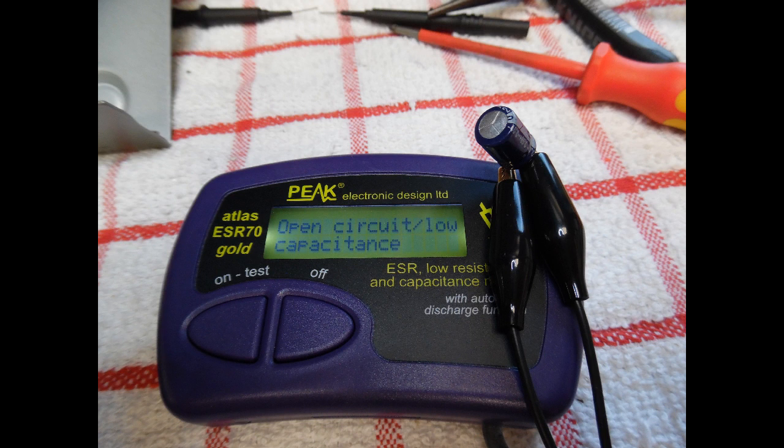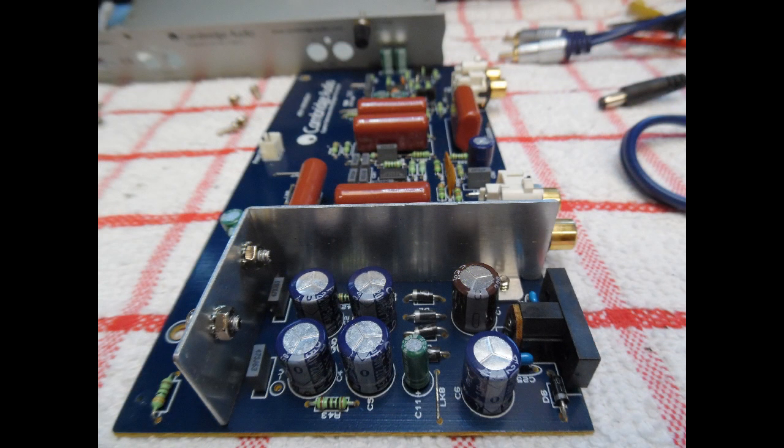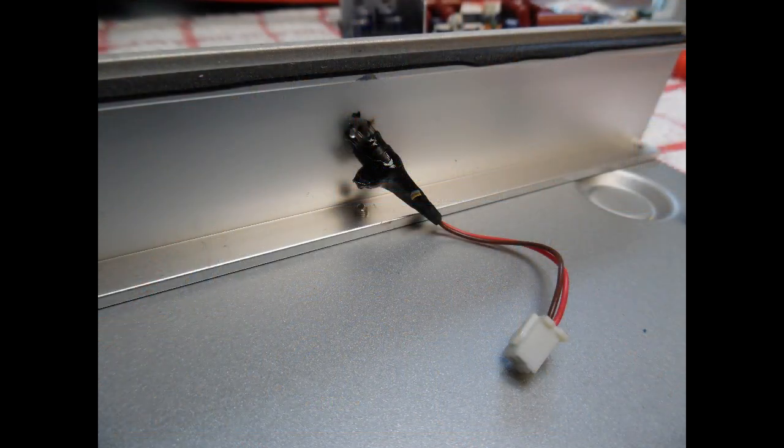This is a very common issue — I've seen many of these pre-amplifiers come in with exactly this fault. Notably, this unit had none of the horrible brown glue that can dissolve components and become slightly conductive. Overall it's a very easy repair: simply replace C1. You can see it was physically beginning to vent, and it measured open circuit. For the replacement power supply, I source a 12 volt AC unit at 1000 milliamps rather than 500 milliamps, which is more than sufficient.